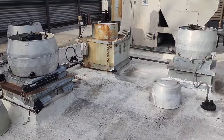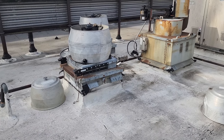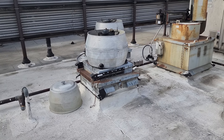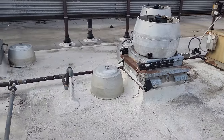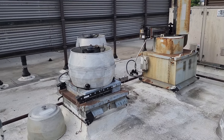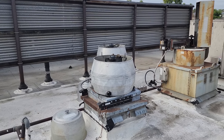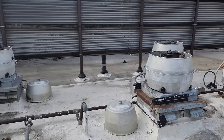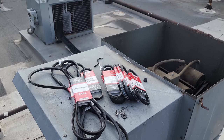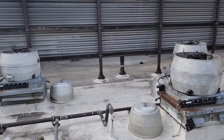We're going to go around putting belts on everything and leaving spares in everything. The manager had called over the weekend — this is a Monday — and the exhaust fan went down over the weekend, but they didn't call us and waited until Monday. I could have walked them through changing the belts if they had proper spares, but all the spares in every exhaust fan were just trashed. So I'm going to leave spares so if they want to change a belt themselves they can, and I don't stock regular belts in my truck — I keep a couple of rescue belts you can adjust the size on for a B belt and an A belt.